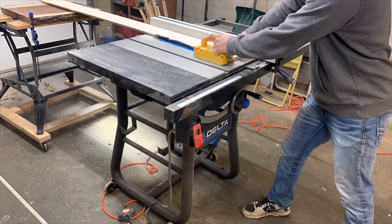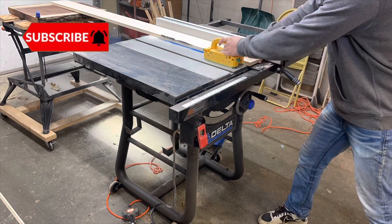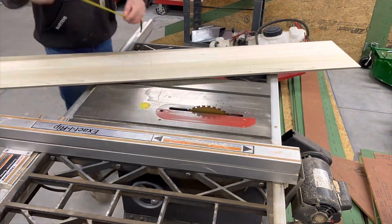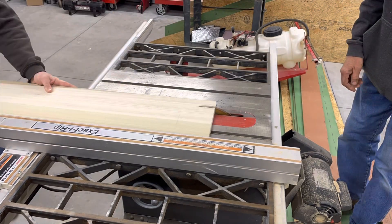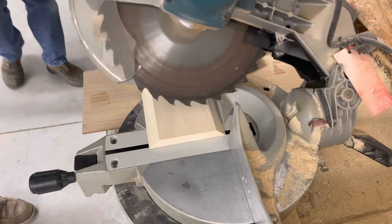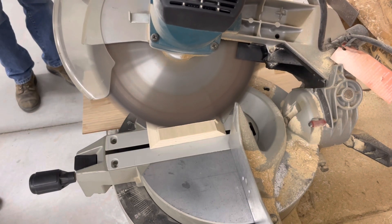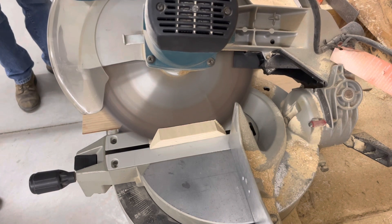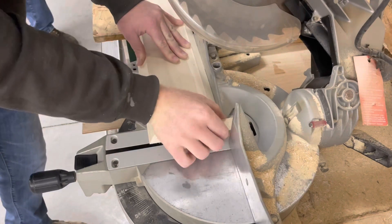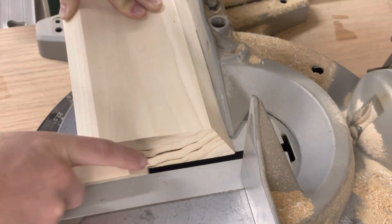Take your time marking out the correct angles for the 45-degree cuts. You want to make sure the show face is still the show face of the project when you are done cutting. I used a combination of a table saw and a miter saw to achieve these cuts. When cutting the angles on the edge of the board or lengthwise, make the first cut on the end taking off as little as possible, then on the second cut on the opposite end just sneak up on it. This is why we left the boards long originally, so we can sneak up on the cut for the perfect fit.